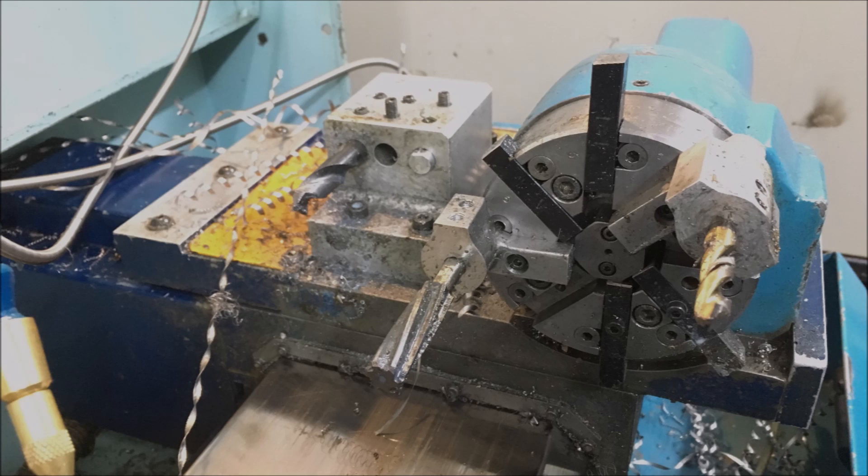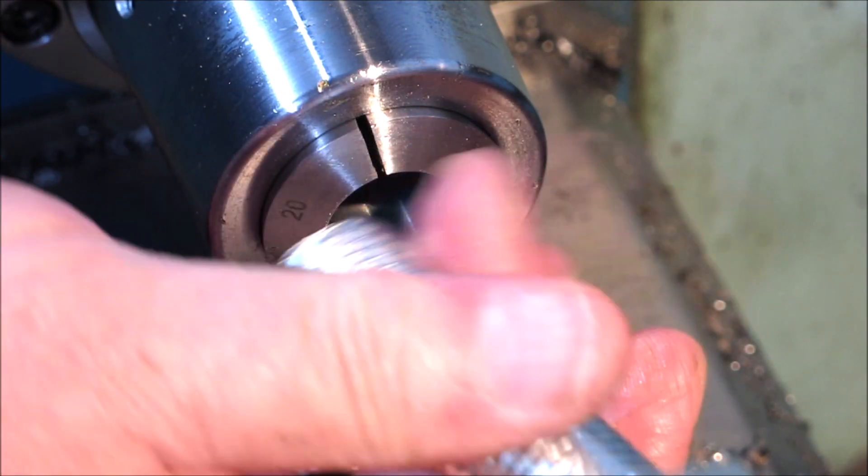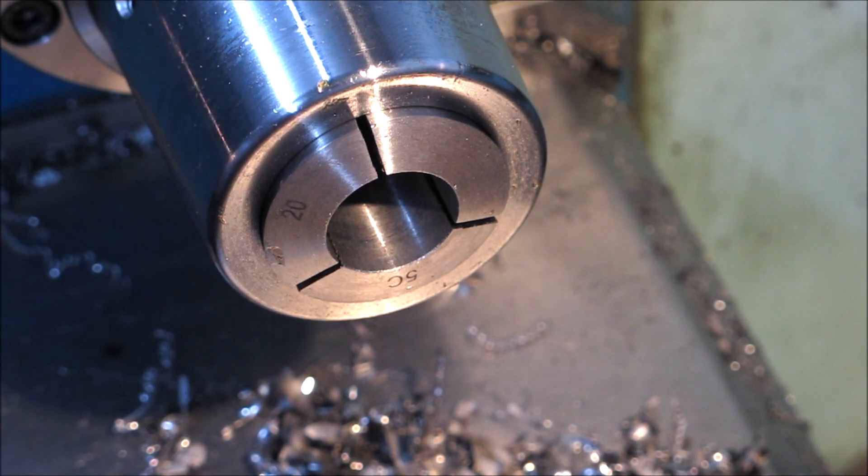There's the turret with the turning tool, 8.5 millimeter drill, half inch reamer. Over in the block there's a 12.5 drill and a little plug filling up a hole that swarf kept getting caught in. Using a 5C collet holder so as not to damage the threads.